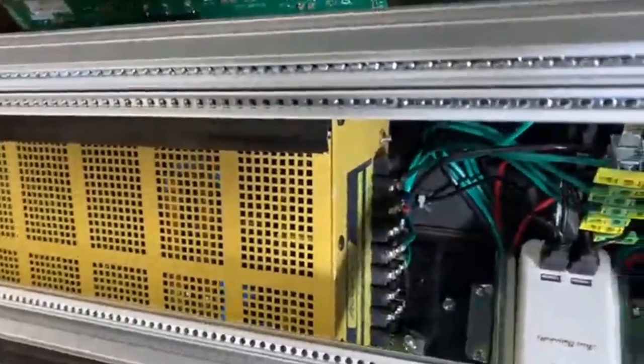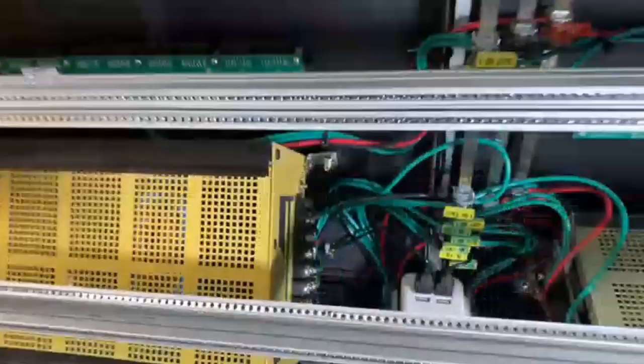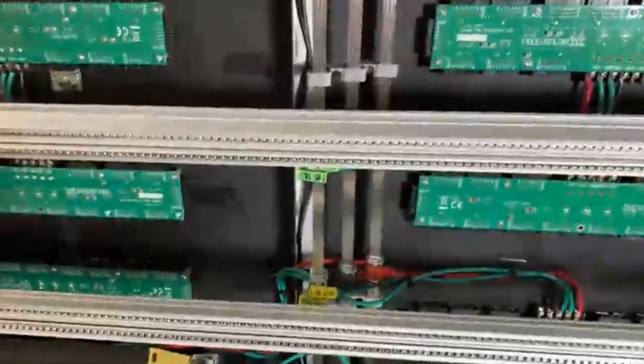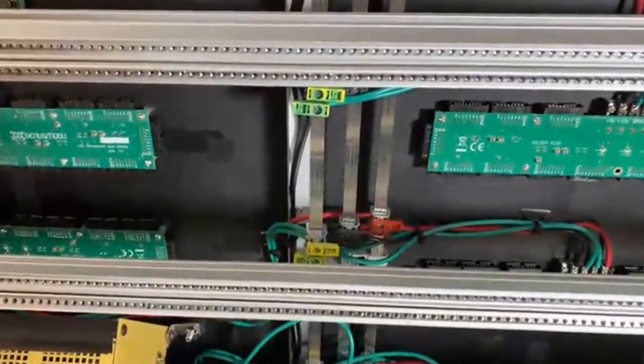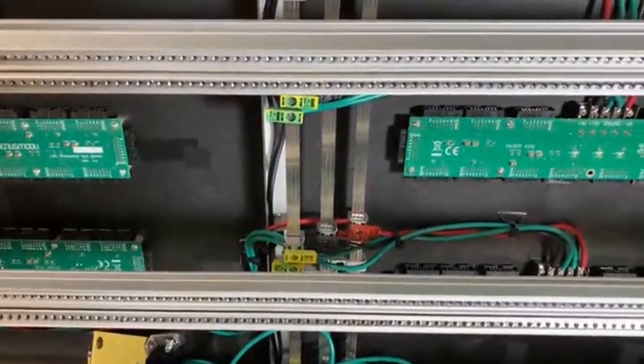But cooling is something I've really worried about in this case, because previously with the switching system, when I had it full of modules, I noticed it just kept getting hotter the longer I kept it on, and some modules kept drifting. So when I had the case apart, I made a point of drilling ventilation holes along the leading edge here, along the very top edge here, and there's also a row of holes underneath both of the power supplies.